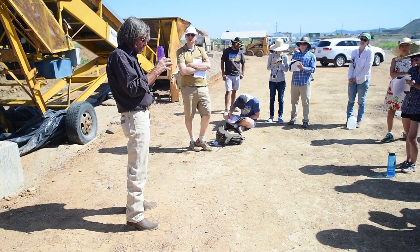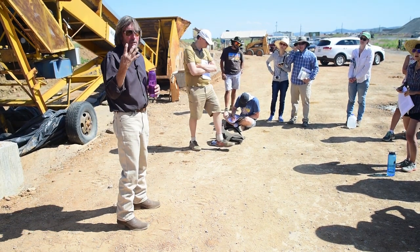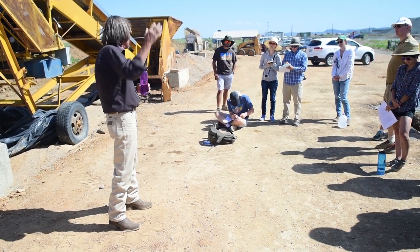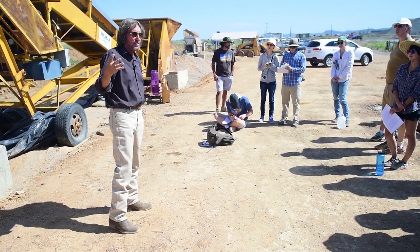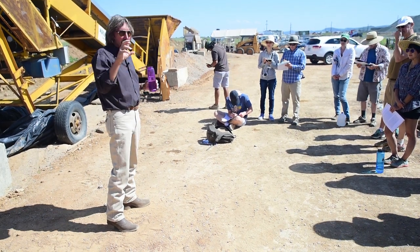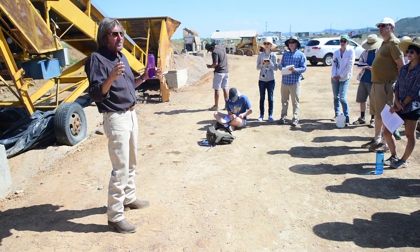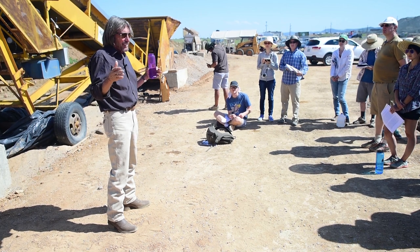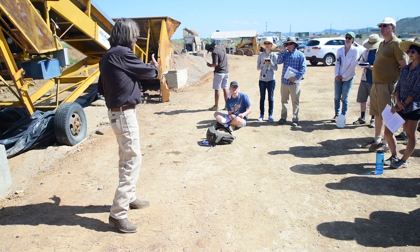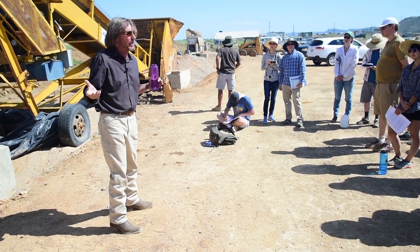when you're stabilizing with cement, well, let me step back just a little bit. There's four ingredients in soil anywhere in the world: gravel, sand, silt, and clay. Different kinds of clay, different size gravel, and so on. But those are the four ingredients anywhere. When you're stabilizing with Portland cement, the cement is grabbing the sand and the gravel and combining. It doesn't really care about the clay that much. You need the clay to hold the block in shape when it comes out of the machine, but you're making a cement stabilized block where the cement's combining with the sand and gravel, primarily.